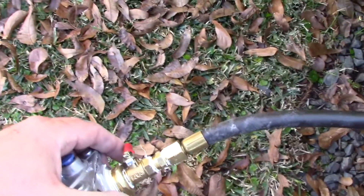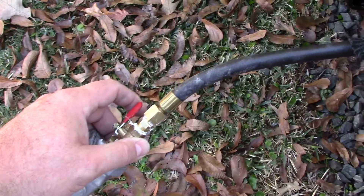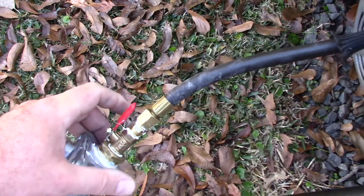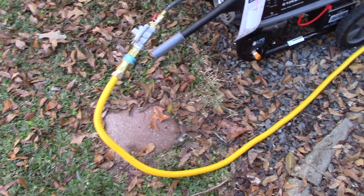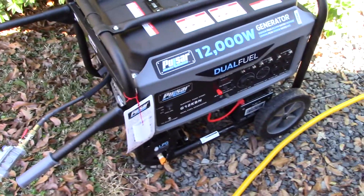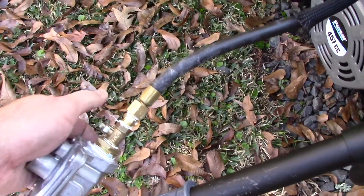This style regulator didn't allow it to prime very easily, so when you're outside you're having to manually prime it through the hose, which became more difficult. The ball valve kind of acted like a throttle as well. This setup ran okay, but it really didn't maximize the efficiency of the generator once we put a load on it. Plus, this style regulator was going to be really hard to mount — it was going to be external and in the way, with a lot of issues that just didn't make it practical.